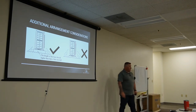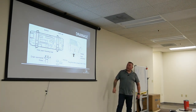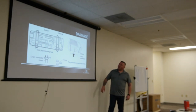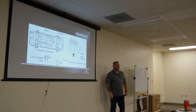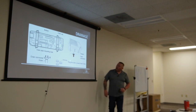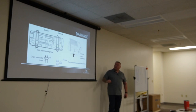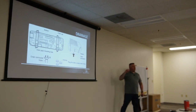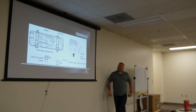On the heat strip side of the air handler, the compressor compartment is in the back corner. We found that in that back corner there's a depression in the pan with no drain hole. In western Canada we've had cases where ice built up and crushed the refrigerant lines going into the coil. We're working with manufacturing to change this, and I advise everyone to address that corner during installation.